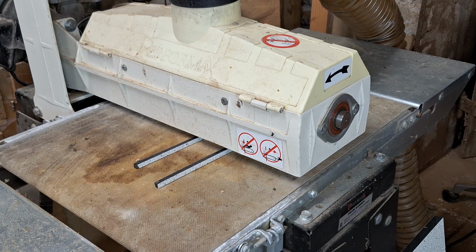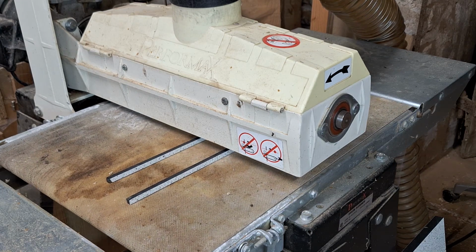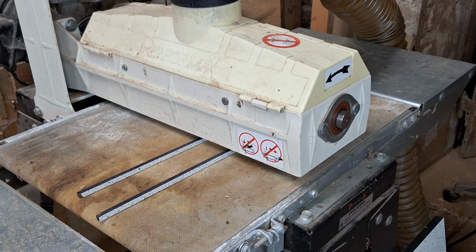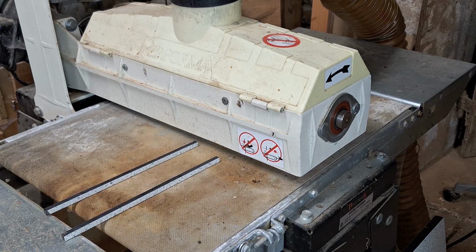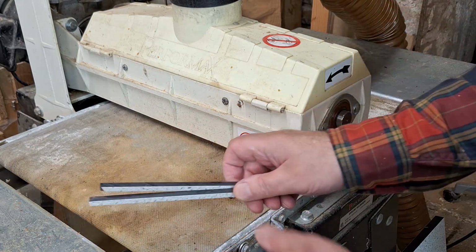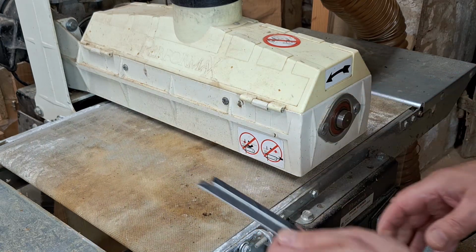They must not be smaller than the grooves, or the two layers will be able to move sideways, which we do not want. They need to be exactly the same size, or just a hair bigger. But because there are two grooves, they are stable, even if they are a tad oversized. We need no slop and no rock.